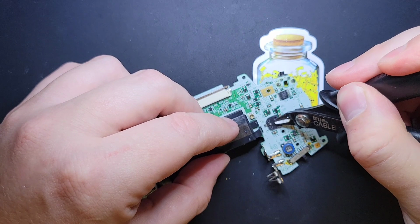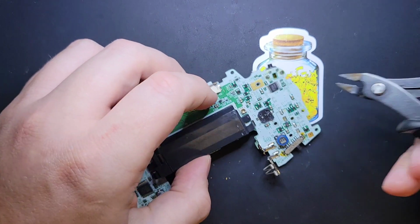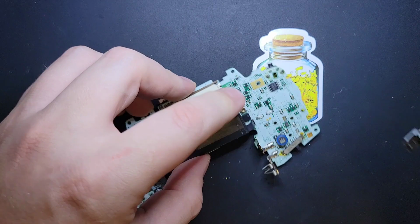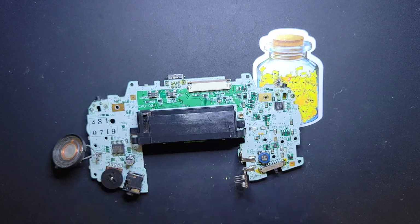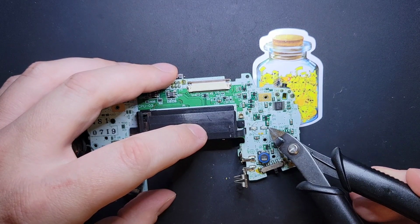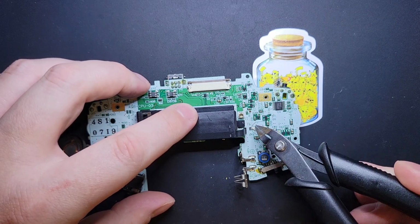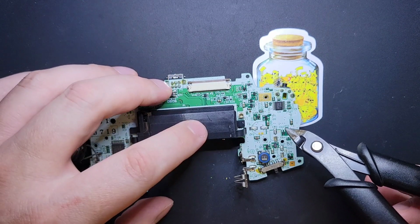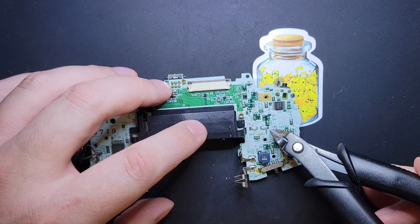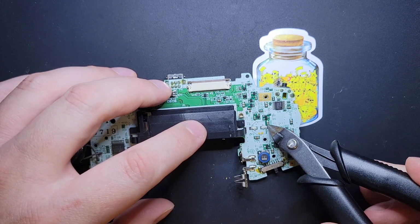But technically, the DMG ones, they're still good, right? For the most part. But these are like the only things with an expiration date, basically. Whew. So you see there, it left the pad, but the little leg actually came off. If one of these rips, you just follow the trace and run a little jumper wire, and that's all you need to do. This one came close to being damaged or ripped. In that case, you could attach it right there. These are 2 negative points.